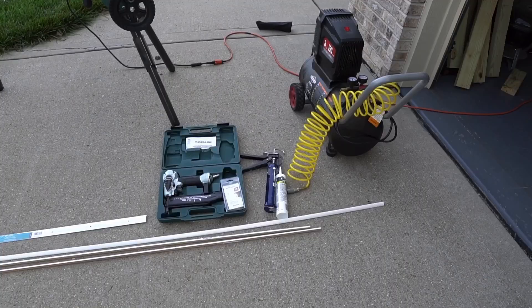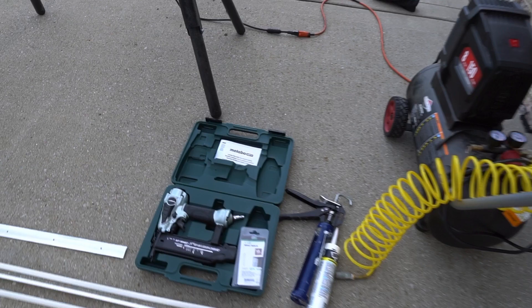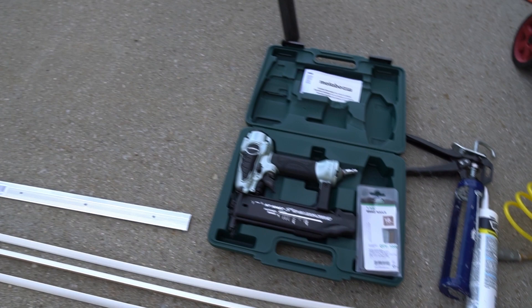New day, and we're all done with the actual flooring install itself, so we're going to be trimming that flooring out. Here's everything we use to trim out the flooring. First and foremost, trim — what we've utilized and had success with in the past is some half-inch by eight-foot MDF quarter round. This works really well for covering up the edges in the pop-up.